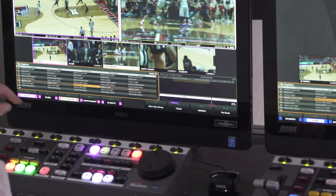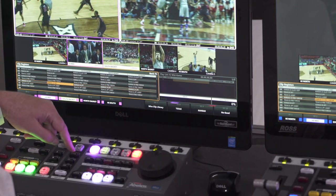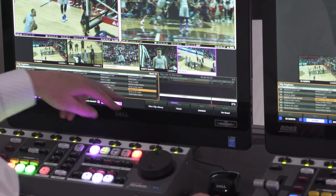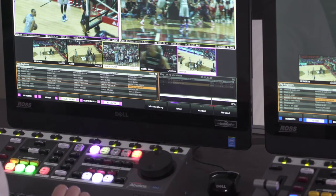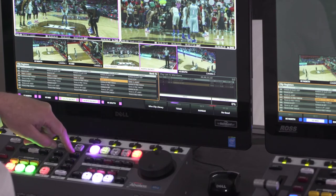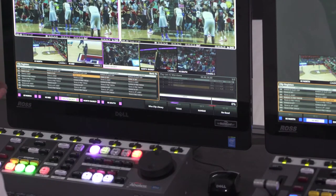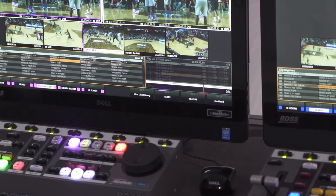Another capability of the Mira Replay system is to place clips into any number of playlists. Here I have some clips in my clip register that I want to insert into a playlist. It's a matter of finding the clip using the camera soft key and then pressing an append button to add the clip into the existing playlist. If I want to add other angles, I simply press the camera soft key and press append to add that other camera. For a totally different clip, I can highlight it and press append to insert it into the playlist. If I want to insert all five angles of a clip, it's a matter of pressing and holding down the append button for one second and all five angles will be placed into the playlist.